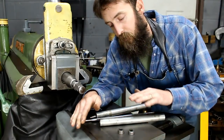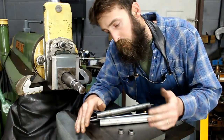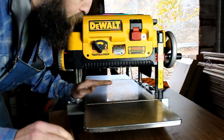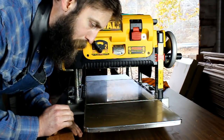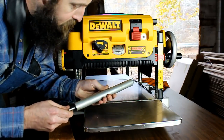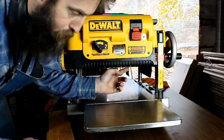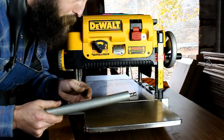I've got a wood planer. It doesn't take rollers like this, but let's go look at it, and I'll give you a better understanding of what these actually do. All right, I apologize for the lighting in here, but here's the bed of the planer. Now, this is a totally different model planer than what these rollers go on. But these rollers basically take the place of this fixed bed. Now, this fixed bed is parallel with the cutter head that rotates in the top of this machine.